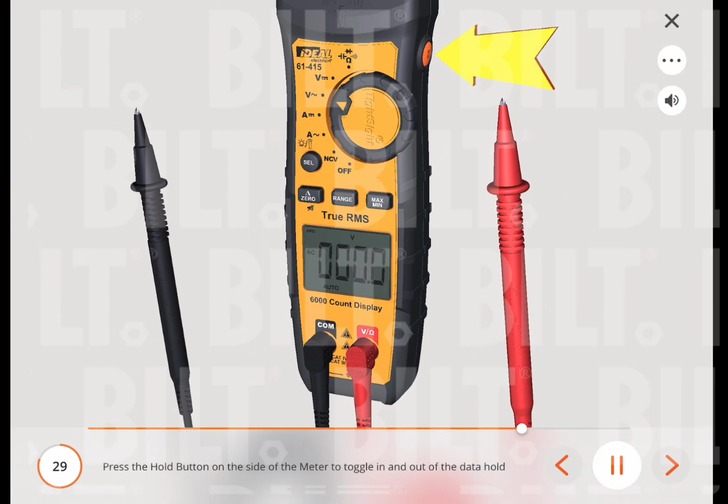Press the hold button on the side of the meter to toggle in and out of the data hold mode. H appears in the bottom left of the meter display when data hold is active. Use the data hold feature to lock a measurement reading on the display. Press the hold button again to unlock the display and obtain a real-time reading.